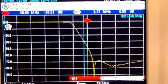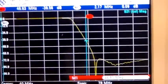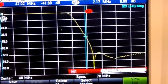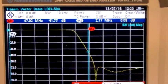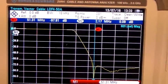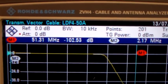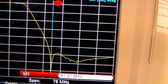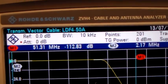Let me try to get you a better picture of what's going on here. I'm operating the gadget with one hand and holding the camera with the other, so it's shaking about a bit unfortunately. We've got a nice steep rolloff — it hits the floor there at minus 100 dB. The spec says 80 dB at 54 MHz, but we're getting 100 dB at 51 MHz, which is better than spec.